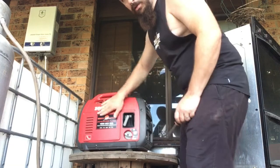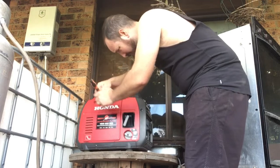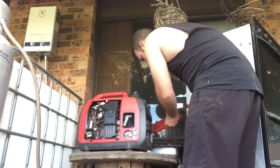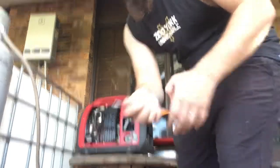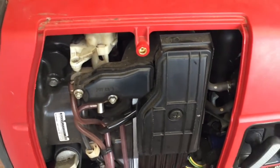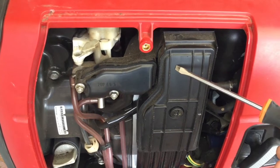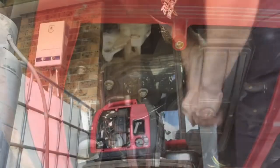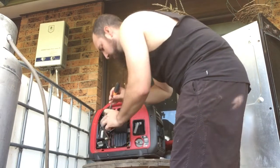The biogas liquid that comes out is very practical. I'll take you over near the house to look at the generator. So the front cover here — we're going to take this off, it's just a screw. Here is the air box and the carburetor. We're going to take this off — there's the inlet past the air filter. All we're going to do is put our gas pipe in there and it's going to suck into the carburetor and into the motor.